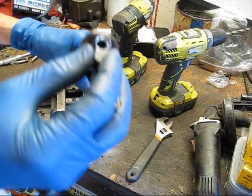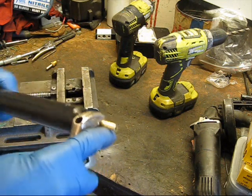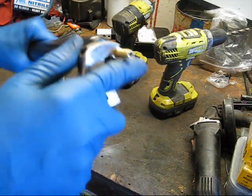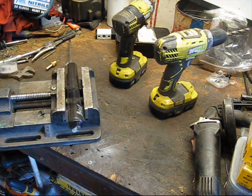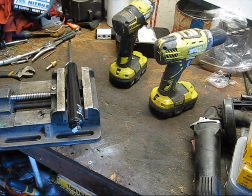It tapped all the way down to the bottom. Unfortunately, this particular combination does not want to thread in all the way until the hex bottoms out — I'm not really sure why. It doesn't, which seems a little odd because last time I did this it did go to about there. Not what I wanted, but it'll work just fine — we still have several threads in there, so it should be good. I'm going to use some Teflon tape for this. There are different schools of thought on what you should use to seal compressed air fittings. I'm going with Teflon tape because it's a lot easier than thread sealant — it won't get everywhere, and I won't waste it if I have to take it back out.